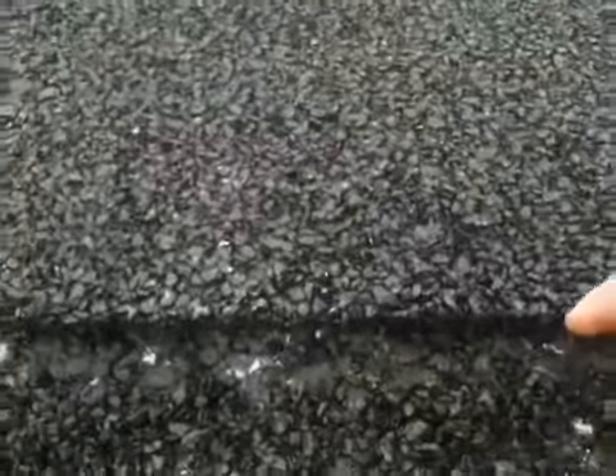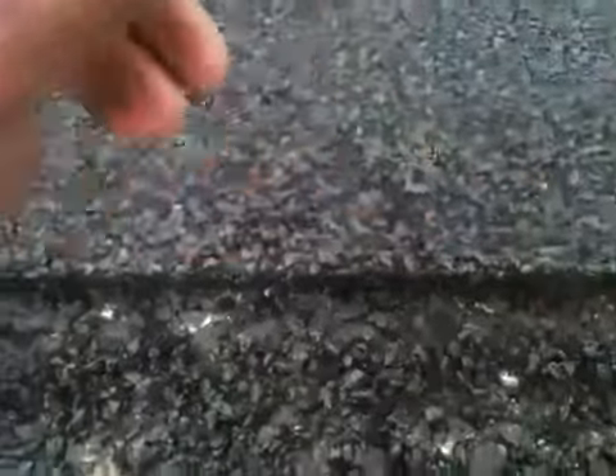This is the finished surface, which is six millimeter open tarmac. If you bring it back you can see a very nice defined edge, as the tarmac is laid in bays. If you point along there you can see the one-inch tubes which actually make up the bays.